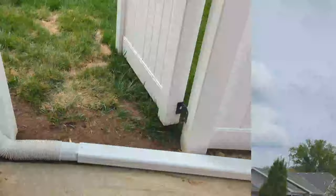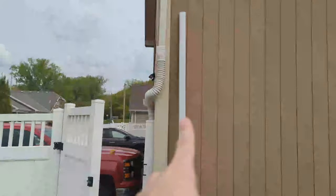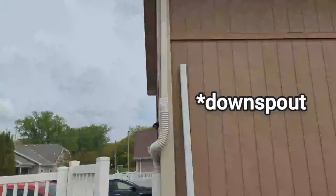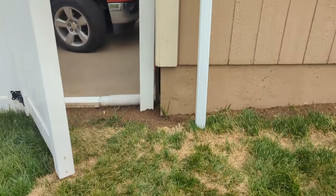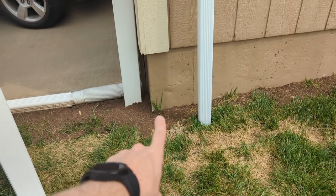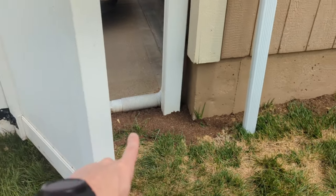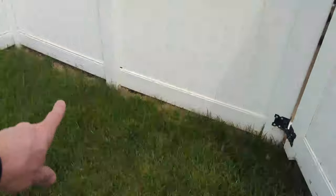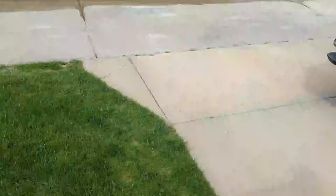Let's get this done the right way. The plan today is to splice in this fresh gutter, put it onto the one that's existing, and bring it all the way back to just above ground level. Then from ground level, I'm going to find a Y connector with a cleanout that will then go down, buried onto a PVC pipe, straight down the fence line, under the fence, and out to daylight here, where I'm probably going to put a pop-up drain or some kind of grate where the water can get out.